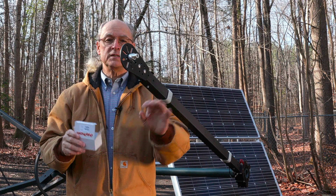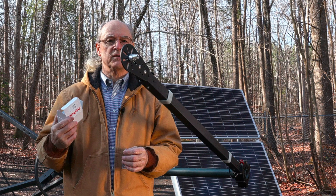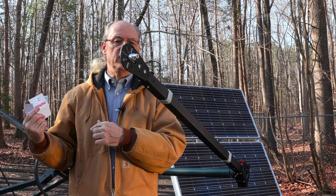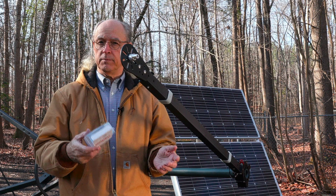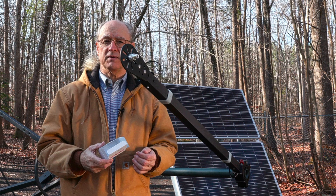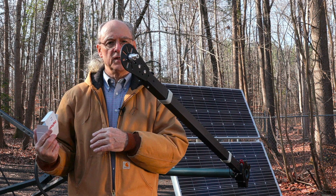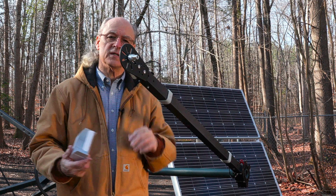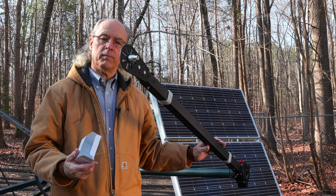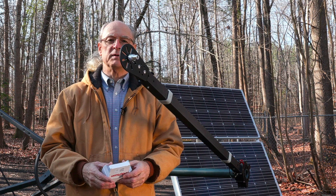This makes it very easy to change the antennas that you're using with the Wave Relay radios based off of the frequency module that's on the radio. Right now it's an S-band, so we're at 2.2 to about 2.5 GHz. We have the appropriate sized antennas on it. If you change to another module, all you do is change the antenna up here. You still have a lightning arrestor, it's grounded into the metal part of the rest of the stand, and you've got your lightning protection.